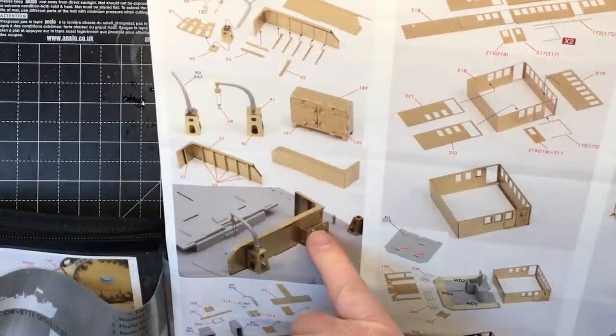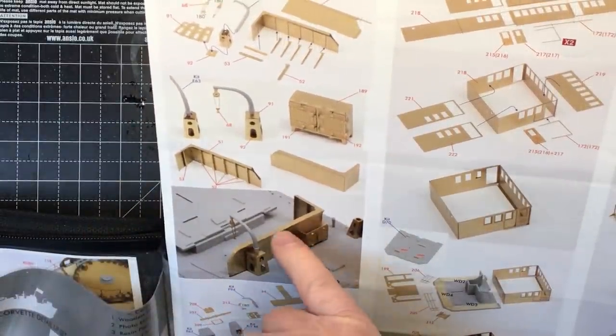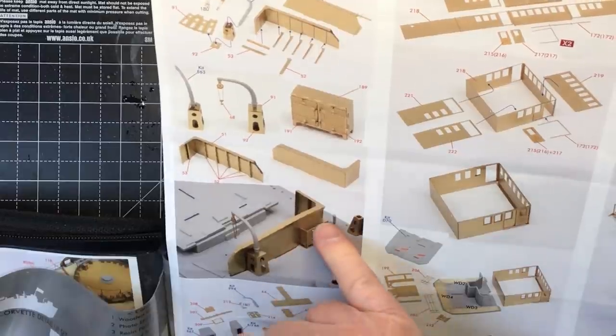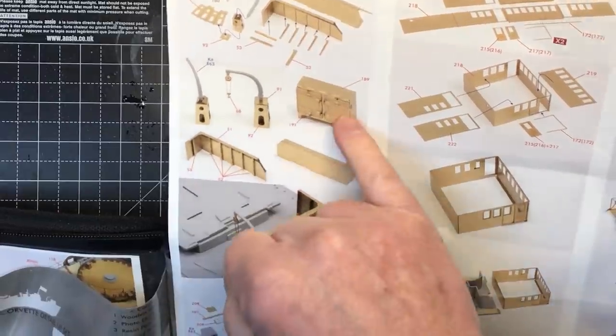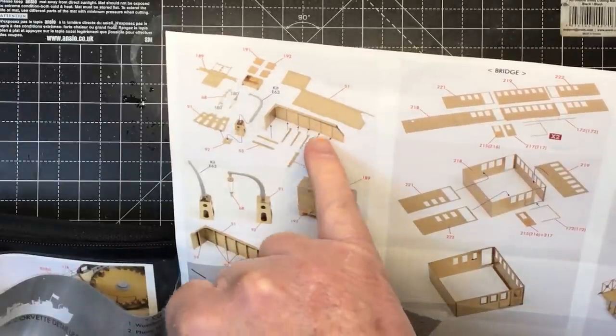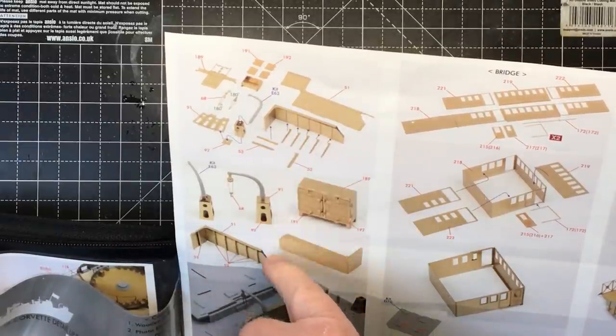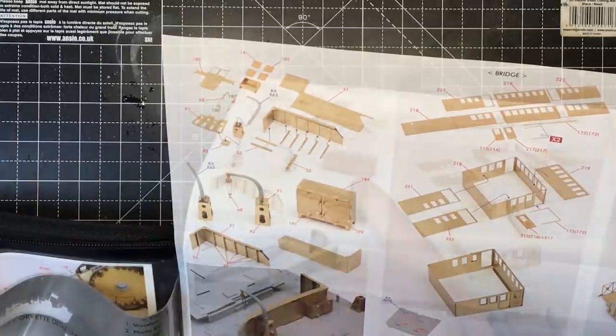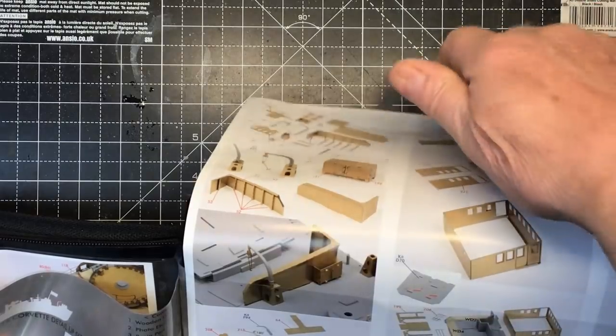So this is the shield that we're going to be building this week. There are a number of lockers that go behind it, so you can see it's just a right angled structure, and as usual with Pontos, we've got a number of ribs to fit, and we've got a base for the davit here to build as well. And we've also got this locker to build